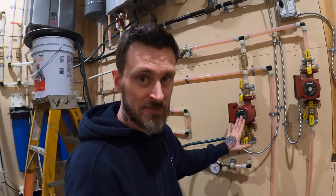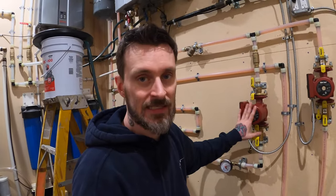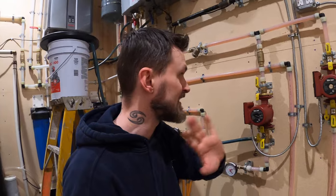It was kind of a blessing that I noticed this pump was basically having an air bubble in it — it must have been locked. It was really hot to the touch. The tankless was running but cycling on and off because the flow on the other end was so slow it would turn on, then have to turn off repeatedly. I spent probably six or seven hours trying to get this 1/12 horsepower pump to work. The 1/25th out in the garage was working, but this one was not. Finally I said enough — let's go to the store and upgrade.